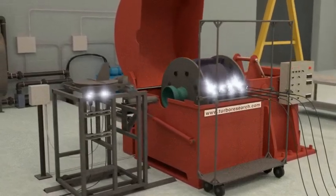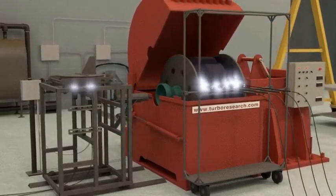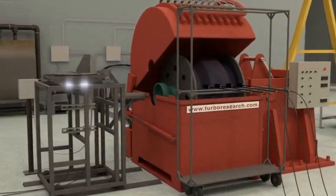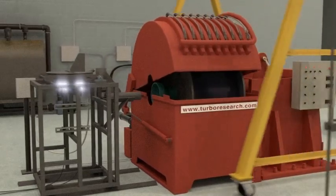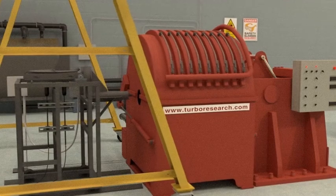When the shell of the bearing reaches the proper temperature, the containment cover closes. The rotational speed is increased and the kettle is lifted with the help of an overhead crane. The babbit is poured through a heated tube into the bearing center.